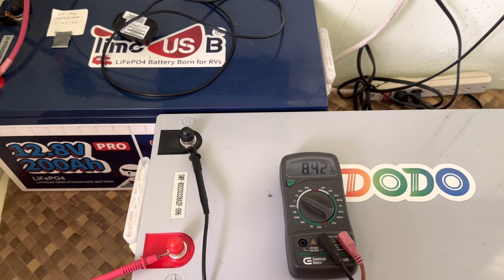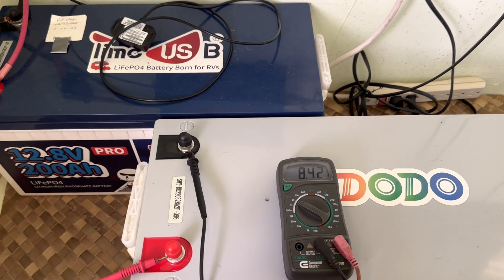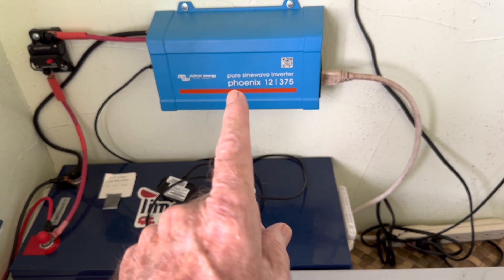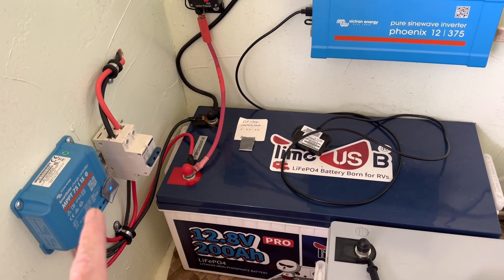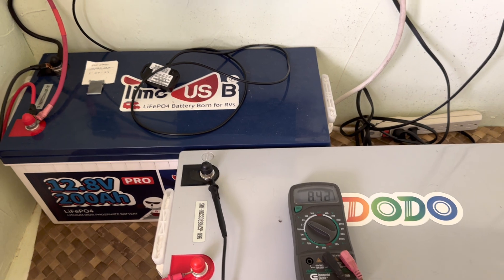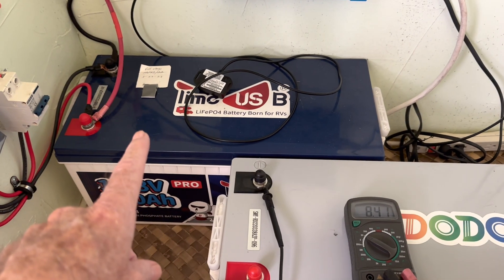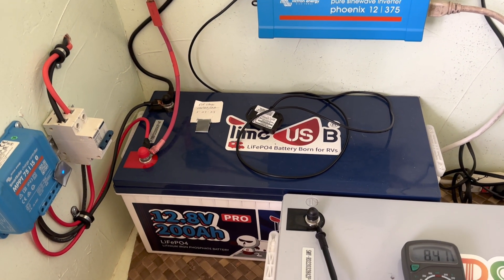You could see it was charging up full and discharging the same amount — my usage remained the same day in and day out for a solid 10 days before yesterday. The inverter had a low voltage disconnect and would not turn on; I couldn't turn the TV on. The charge controller said everything was heading towards a full charge, just throttling the power down from the solar panels. I came in, disconnected this battery, put the voltmeter on it — sure enough, low voltage disconnect.